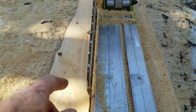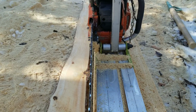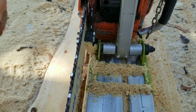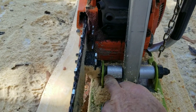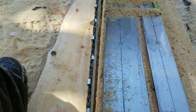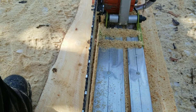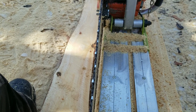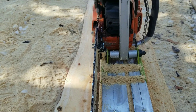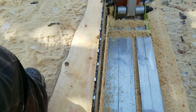If you look at the alignment of the bar, it's perfectly in alignment with the guide — there is no offset. As it came from the factory, this Timber Tough was not perfect; when you bolted the chainsaw in, the block wasn't perfectly square, so the bar was probably angled like this. The saw is trying to get through the wood but it can't because it's trying to curve itself the whole time and it doesn't work. So make absolutely sure when you use any of these beam cutters that your bar is perfectly square with the cut you're making, or you're going to tear your hair out.